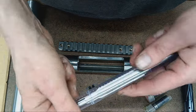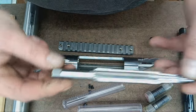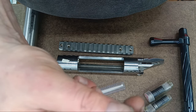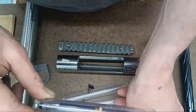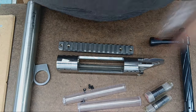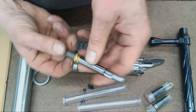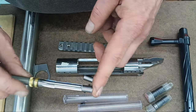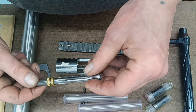And then we have some PTG finish chambering reamer with a live pilot on it. And with a 370 neck, no, sorry, 3705 neck and a 0.01 freebore. This guy wants the freebore extended about 20 thousandths of an inch. So we have a uni throater by PTG as well. These are pretty snazzy, fancy tools that allow one to control the depth of the throat by means of these knurled brass set screws. Generally a throater, you'll just feed that in. You got to pay real good attention because you can't feel it really, but you can hear the wisping of those flutes as they cut.